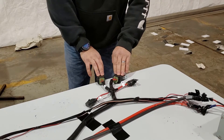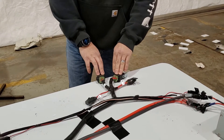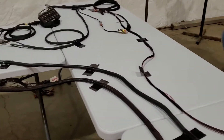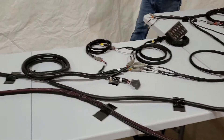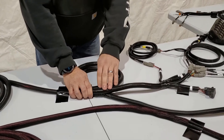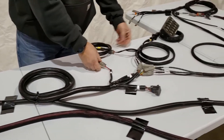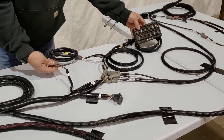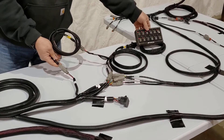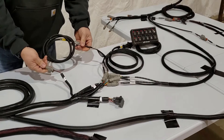Solenoid power is going to provide power to turn the ECUs on. ECU power relay is used to put clean power to the scales. So we've got our power here, and we can follow it out into the rest of the system — all the way back through this harness to that Y in the tractor harness. From that Y, it's teed in, and it's going to give power to this switch box. We've got our switch power out, which is going to allow us to power the switch box. It's teed into the CAN network, but it still needs to get power.